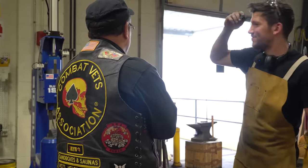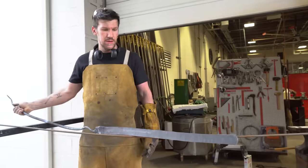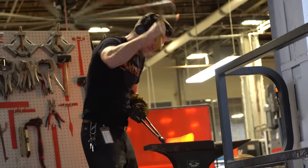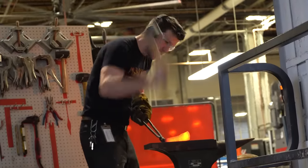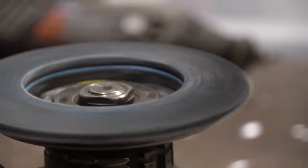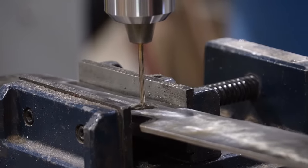David and Mona Waldeck from the Combat Vets Association decided to stop by, give a little feedback — we're all really excited to see this thing go to auction and help out the veterans who need it. I got the billet up to 640 layers, cut it down to size for the knife, and now I'm gonna hand hammer out the finish. The knife is shaped out by hand, so now I'm gonna clean it up on the grinder, drill the pinholes, and get it ready for the quench.